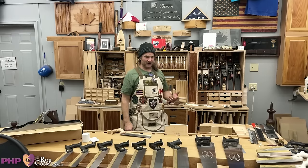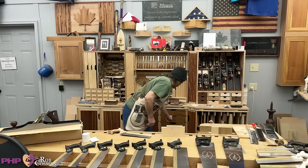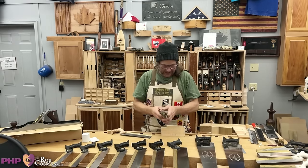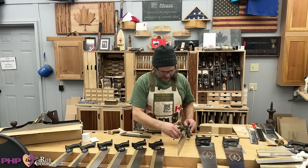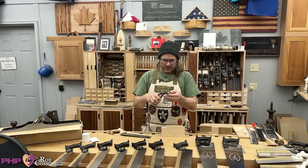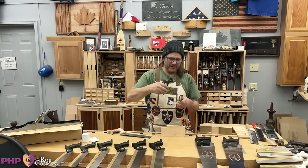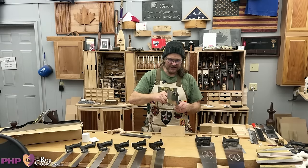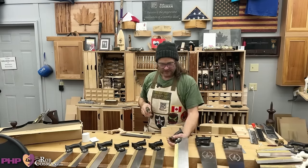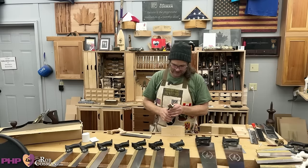What you're probably going to have to do is buy a saw set. You may have to actually go in there and modify that pin. So a saw set looks like this. When you put this down on your blade, it rests there. There's an anvil, and as you rotate that anvil, the angle gets more severe. There's a two-stage plunger when I pull that trigger. The first one pushes the blade tight against the anvil. The second one pushes a little plunger that then pushes the tooth up against the angle on the face of that anvil. You may have to file that little pin so that it only touches one tooth instead of accidentally touching two or three at a time because they're so small.